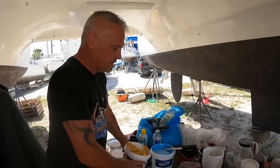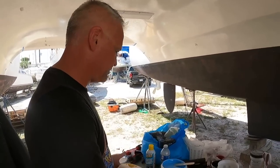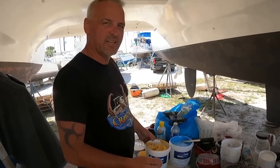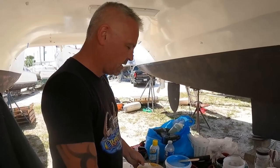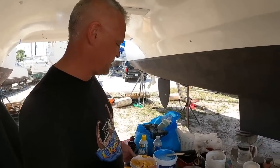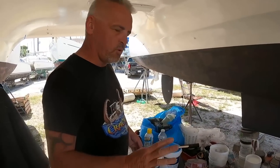I've completely lost track of what day it is that we've been on the hard. Hey guys — new product: using the TotalBoat Total Fair, which is an epoxy-based fairing filler. I've done a little test run on one of the sugar scoops and I'm going to run you through how it mixes. On the can itself it doesn't actually have much in the way of instructions, but it's all on the website. Erica's been through all the drying times — it depends on temperature; the higher the temperature the less working time and the faster drying, and vice versa.